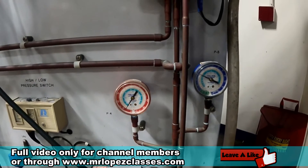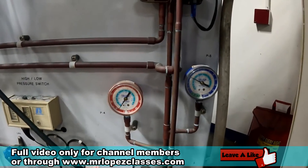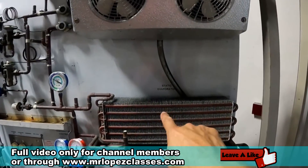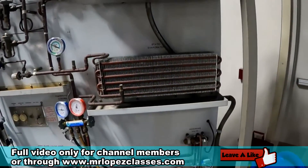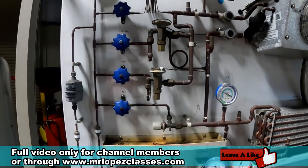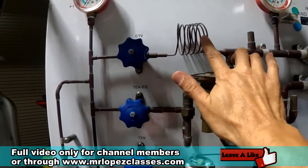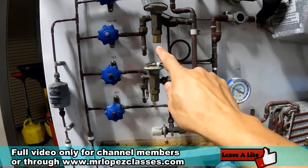For that reason, today we are going to recover that refrigerant, do the vacuum, and after that charge the system again. In this training equipment we have two evaporators — one static evaporator and one air-cooled evaporator — and we have different types of expansion valves commonly used: the typical capillary pipes expansion valve and the thermal expansion valve.